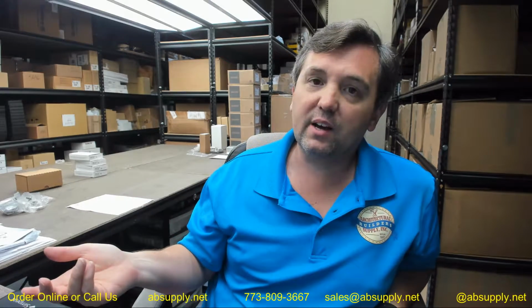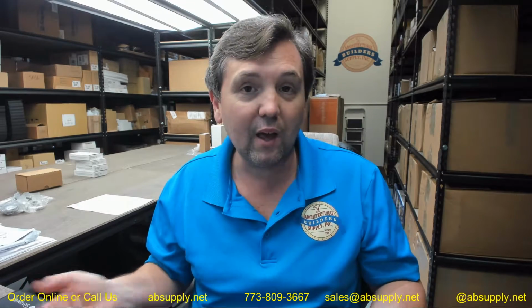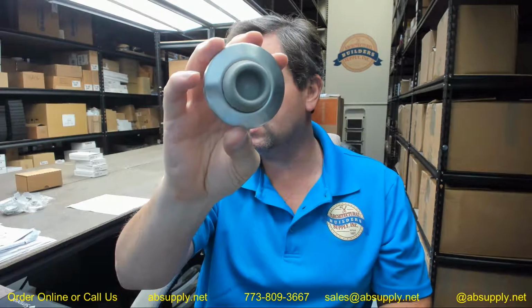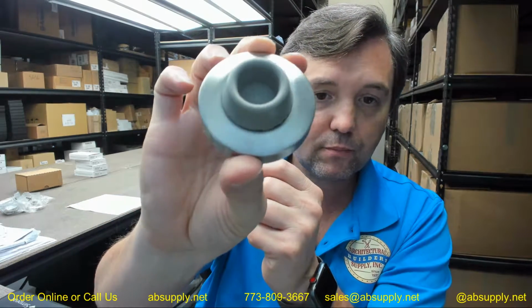Certainly, you could use them in all instances, and some people, if they've got 50 doors that they need wall stops for, rather than saying, give me 30 of the convex, give me 25 of the concave, and I'll return what I don't use, well, it's more work than it's worth. You could just possibly use all concave. Anyway, this is the WS Wall Stop 407 CCV concave. This is going to be in the 32D finish. That means that this is stainless steel on the outside.